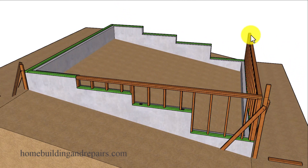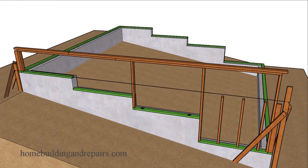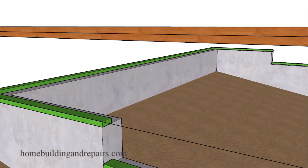I really cannot stress this enough — make sure that all of this is straight and level. In our next example, I'm going to raise the framing plates. Again, you can use a string on top of the framing plates, or use batter boards or guide boards, then calculate the height of the wall here or here, calculate the difference, use the length from your string, and simply add that calculated length to the top of the string line to calculate the height of your new wall framing studs — going from here up instead of down. Then subtract for your framing plates.